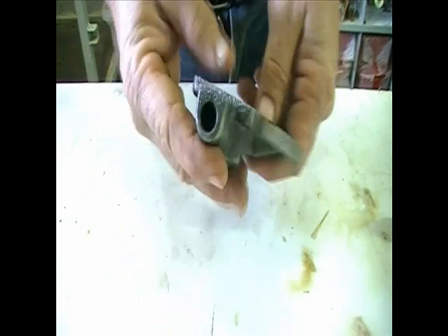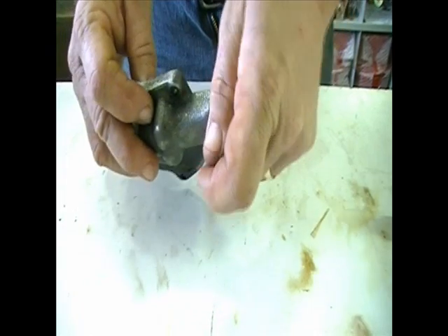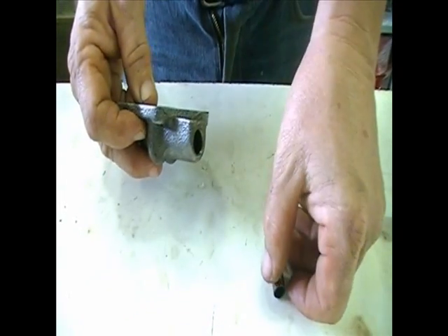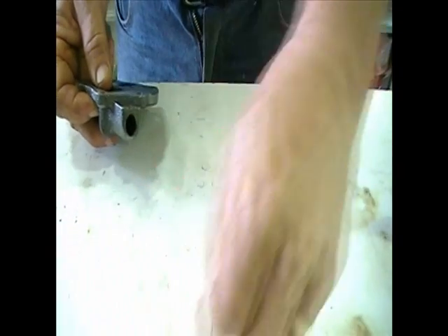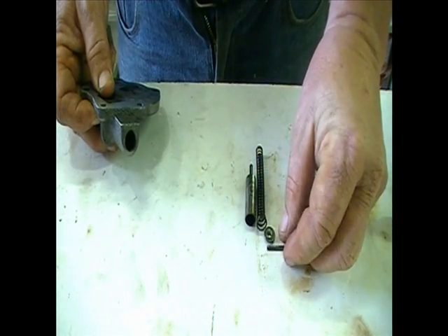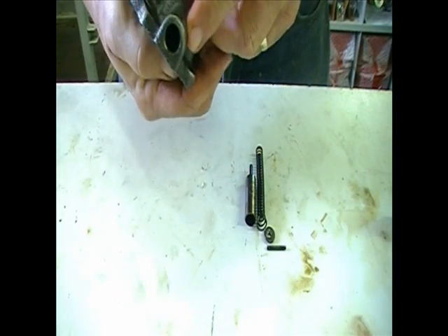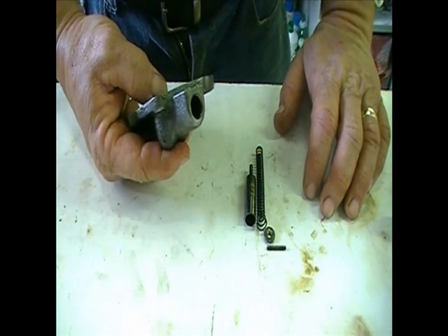When I did, I removed the shuttle from the pressure relief valve. Inside there was a spring and a little washer over the end of the spring, and then a little roll pin that went down through that end right there. It wasn't much holding that in and I just really wasn't too happy about that.